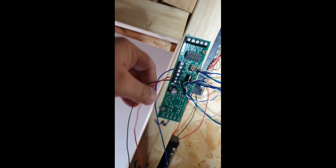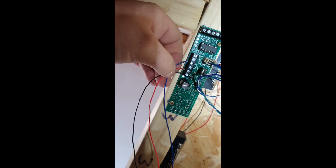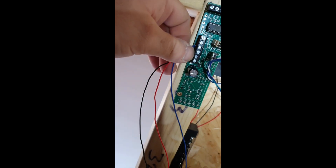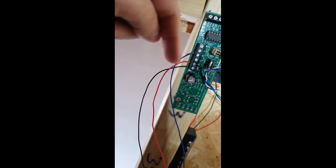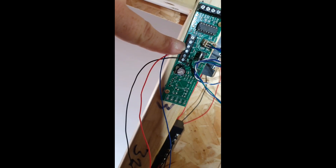I have now put in the negative into the first port, the positive into the second, and the third one is the send. If you were to put a wire in there, it would go to the next board going that way. But because I've got boards on that side, it goes into the receive slot.